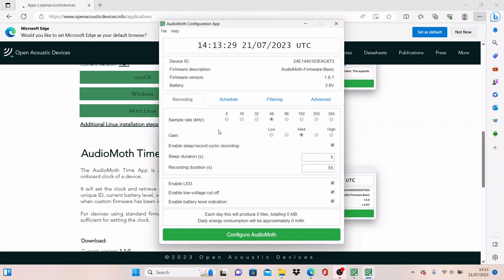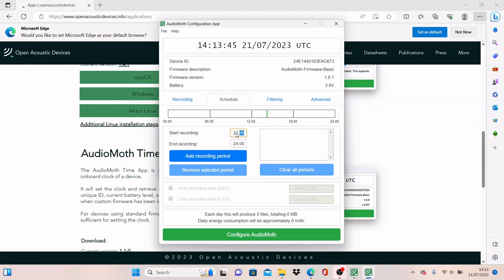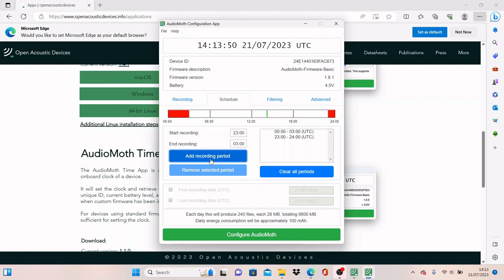The second thing you need to do is open the AudioMoth configuration app. This looks a bit more complicated but we're not changing too many settings. All we need is a high kilohertz sample rate — it helps recording bats — a medium gain, and when scheduling we want to record when bats will be active. So probably 11 o'clock at night to 3 o'clock in the morning, and hit 'Add Recording Period'. You can see on the 24-hour graph where it's going to start recording. If we look at the bottom it'll tell you the number of files and the amount of memory it's going to use. All you'll have to do is hit 'Configure AudioMoth' and you're done. At this point you can take the cable out and if you switch the AudioMoth to custom you should see either a green flashing light if it's calibrated and scheduled to record, or a red flashing light if it is currently recording.